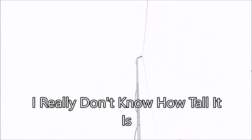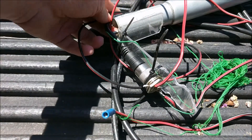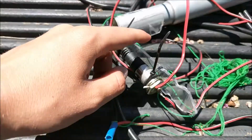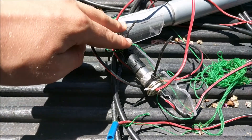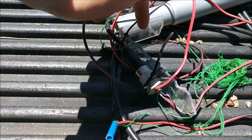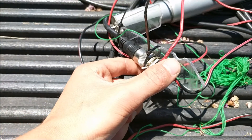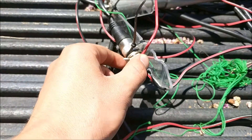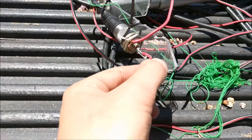Moving up the line, the antenna reaches the top about 10 to 15 feet in the air. Here's a closer look at the top — this is where the antenna is connected. The coaxial cable comes up here and is zip tied to this piece of plexiglass. The plexiglass was bent into a little angle and screwed onto the metal pipe via a hole drilled inside with a screw and a nut. I made little indentations with my grinder in the plexiglass so that the wires can hang out and have a place to rest when they come out.